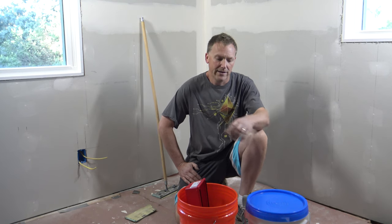In this video, I'm going to discuss what I think the number one mistake is for do-it-yourselfers when they do their first drywall tape and mud project. They go out and buy this bucket of pre-mix and they start spreading their joint compound. There's nothing wrong with this pre-mix, but you have to water it down — it comes way too thick.